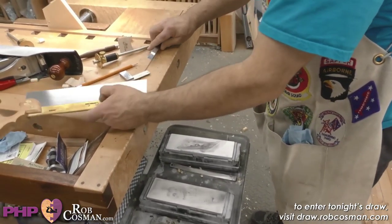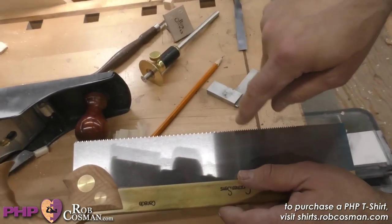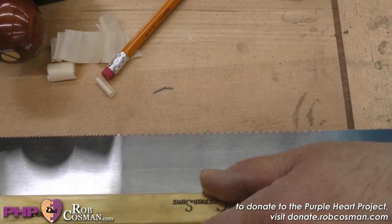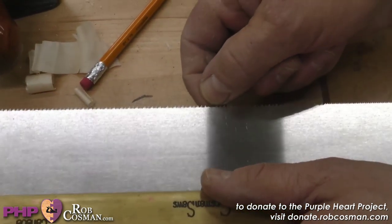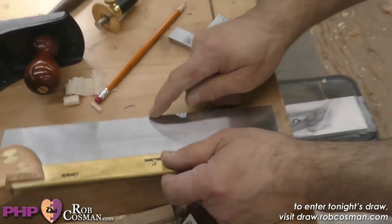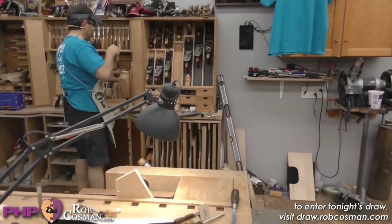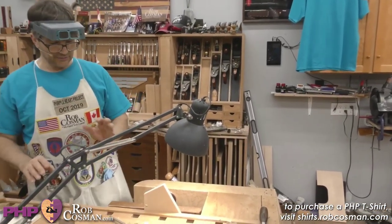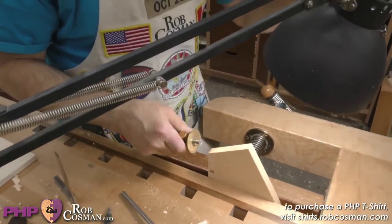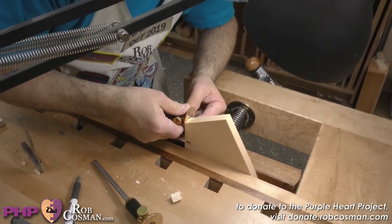And this is the best example, look at this saw. Imagine that being the end of my chisel. There's my 500 grit scratches created by the 500 grit abrasive particles on the stone. Now, if I set that on there and I raise it up higher than the previous stone, then all I have to do is get rid of those and replace them with much smaller scratches, in this case 16,000 grit. But instead of having to do the whole surface, I just do the very edge of the blade, which results in just the little tips of that cutting edge. So to summarize, for speed, it makes it really fast and really accurate. I can't imagine trying to duplicate that exact same bevel. It would be impossible, just hit or miss. Lucky if you got it. You don't have to worry about it with the tertiary bevel.